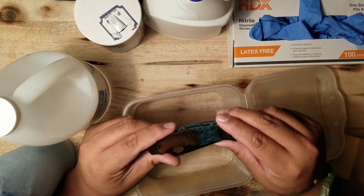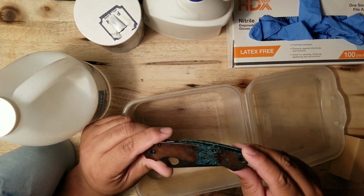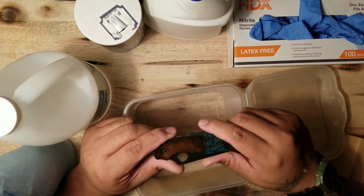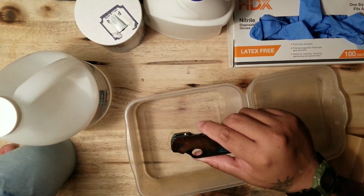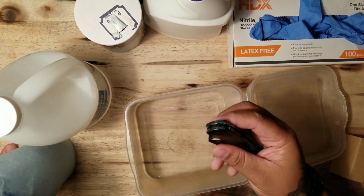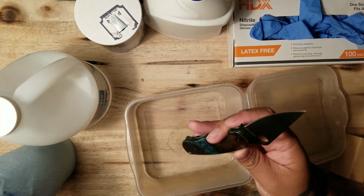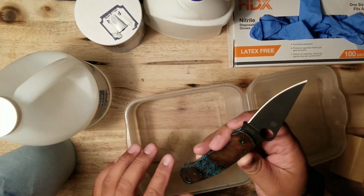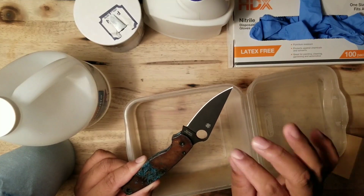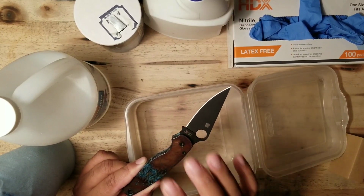Really didn't turn out the way I wanted it to. And part of the reason might have been because my buddy did clean them, and I didn't think to clean them. I just figured, oh, they're clean, there's nothing on them. Wiped them down, and just went for the patina process, and it obviously hindered the process a little bit. So I would recommend completely cleaning down the copper surface, even if you have to get some super fine grit sandpaper, and just lightly go over the copper, get it to a raw state would be the best.